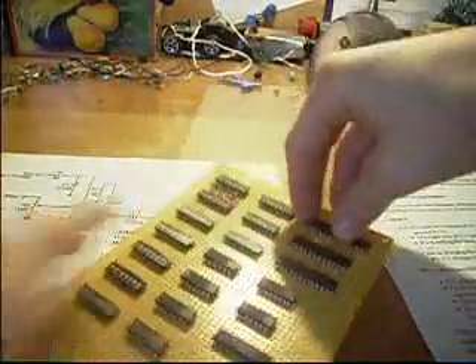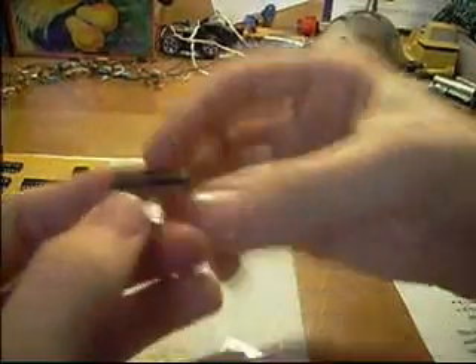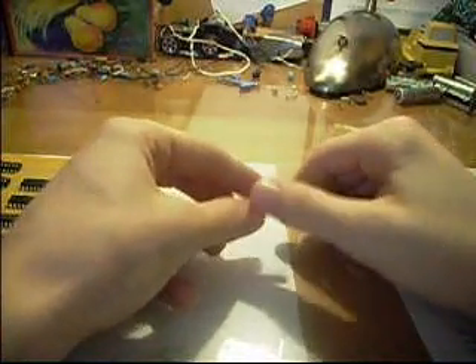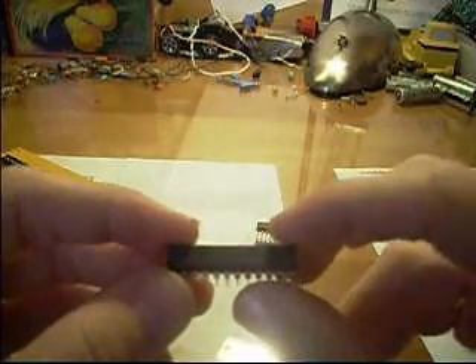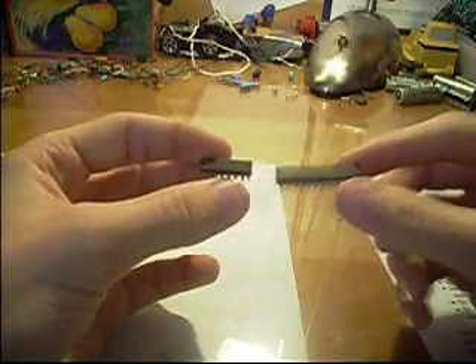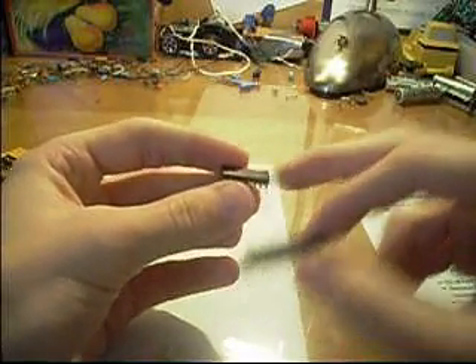What I did to compensate is that I grabbed my 4-bit counter chip, the 74HC163E, which is a 4-bit binary counter with 4-bit binary loading. This would work with another 4-to-16 decoder, the 74HC4514. They would work in unison and essentially act as a 4017, but I still have the ability to load in any address I want through the 74HC163E.